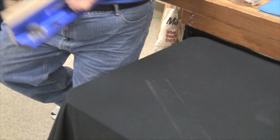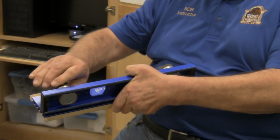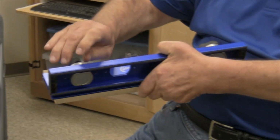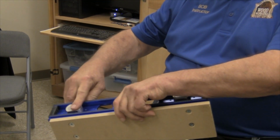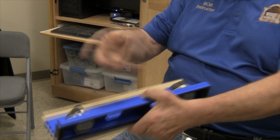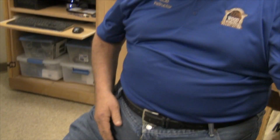We got this one for this particular saw because it's a magnetic switch. You give this thing a quarter turn, and I think it locks when it does. Yeah, like that. And that engages a rare earth magnet on here. You get both of these front and rear, and you can hang on it, and it won't come loose. The only disadvantage is you need to do equal measurements from your miter slot to make sure it's parallel. But I much prefer using a parallel fence like that to do resaw work.